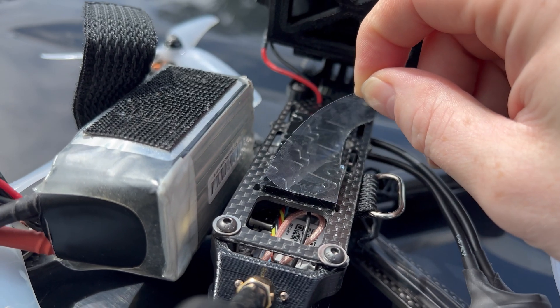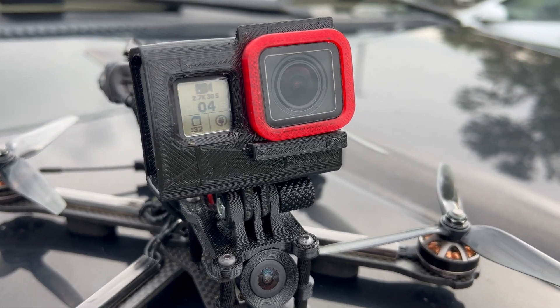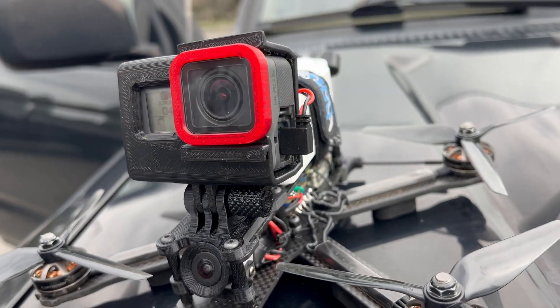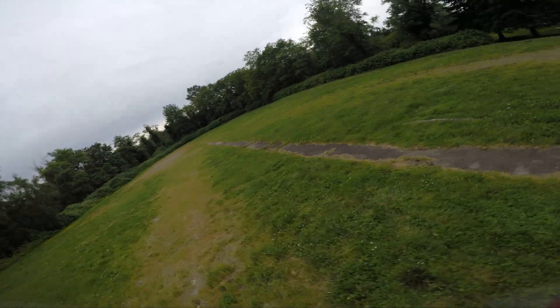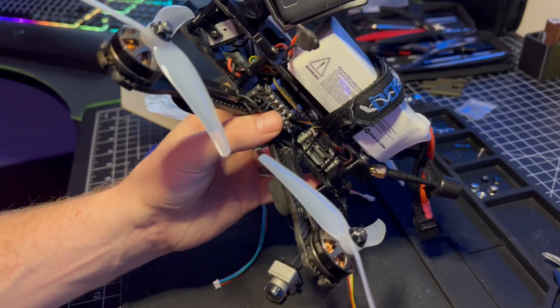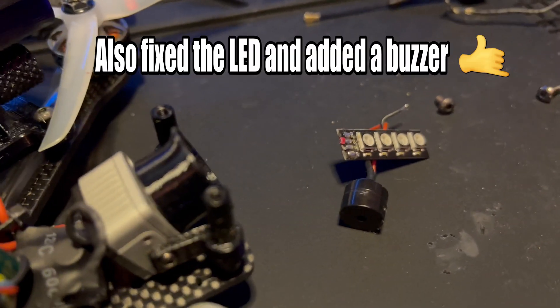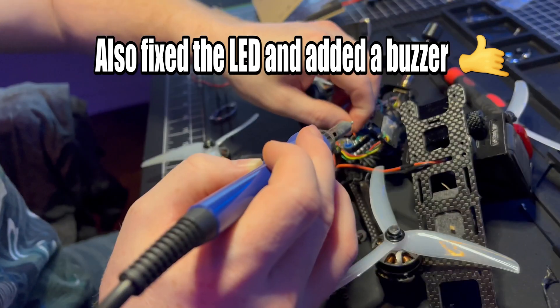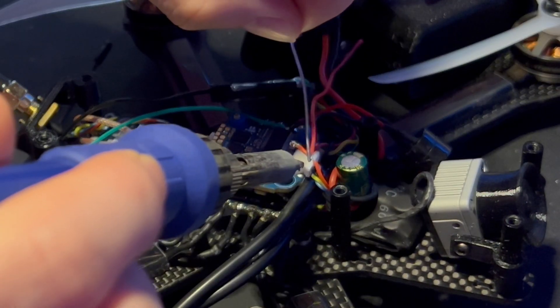We're out here for the maiden and I'm going to be running this thing on 5S all the time. These little motors just don't want to carry a full-size GoPro even minus the battery on 4S. I was actually super pumped for the maiden — it wasn't the nicest day but I got out there and just started ripping right off the bat, and then lost video after a hard roll. Had to go check the FC. As it turns out, the flight controller has a bad 9-volt regulator, so I had to bypass that and go straight to battery voltage to the Vista. That's fine — I'm running 5S, it can handle 6S, and I've got some pretty big capacitors on there so I'm not worried about it, but I had to do the bypass.